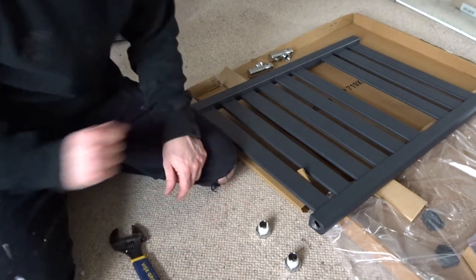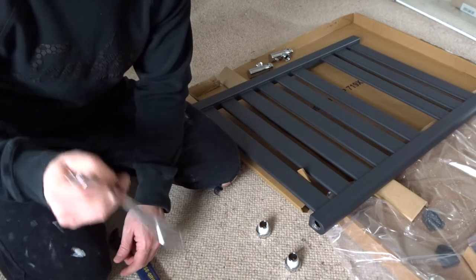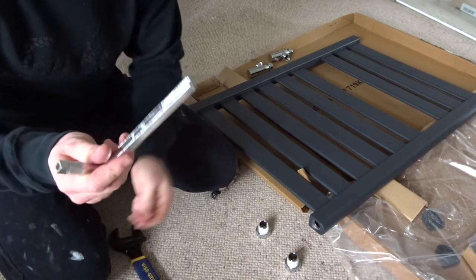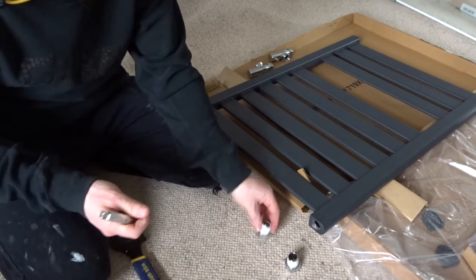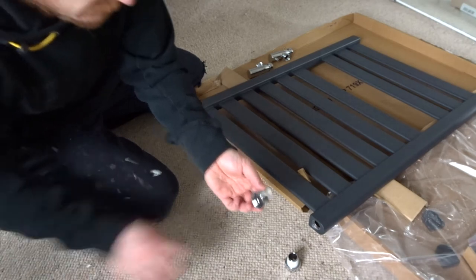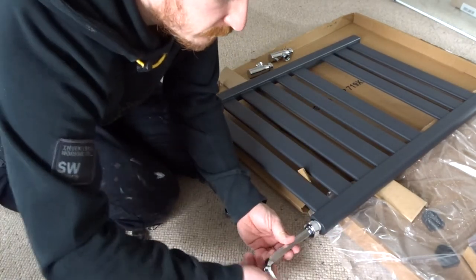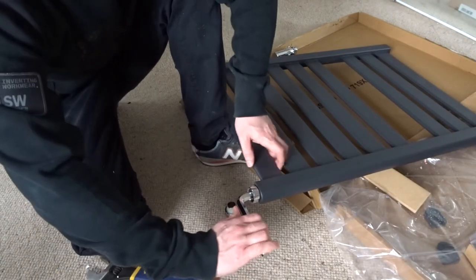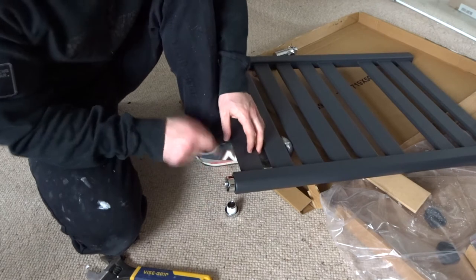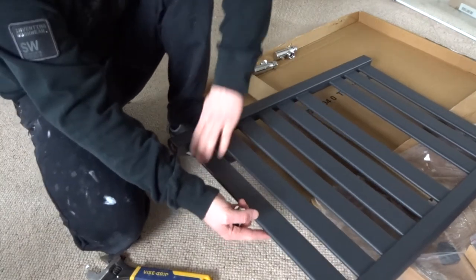So they're ready to be inserted into the radiator now. Grab yourself a radiator allen key or a radiator spanner — I'll put a link to this in the description, it's a pretty cheap tool but without it you're going to struggle. Grab your valve, you can see it's got the hex key slot in there for the radiator spanner. Wind that in — you don't want to over-tighten these, just nip them up, because if you over-tighten them you'll strip the thread out of the radiator. Repeat on the other side.